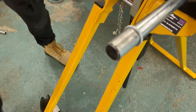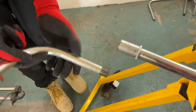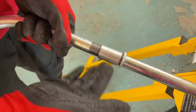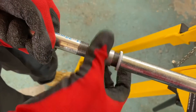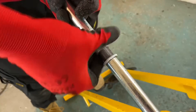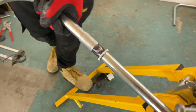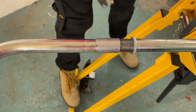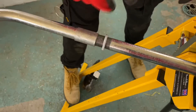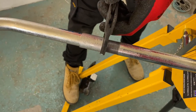Let's have a little look — just there, I've got it in focus for you. So swing this one in — it's the same as we were before. It's nice and tight, quite firm to get it into place. Roll the two together and start to spin the coupler on now — incredibly easy. Tighten it onto there with your grips. It's important to do that first rather than nipping on the ring. So nip that one up, lock that into position. The idea of the ring is to stop it coming back off and loosening off — so nip that up with the grips as well.